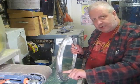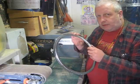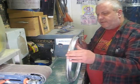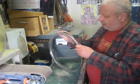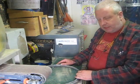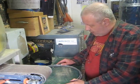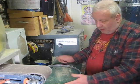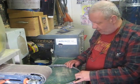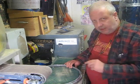It has a distressed look, but a distressed look is better than a flaky look. So what I'm going to do is carry on working on this, get rid of all the flaking chrome, and just rough up the existing chrome so it has that sort of stainless steel, brushed steel look. Hopefully it will be a success, and if it's not, well, I've learned something. If you don't try these things, you don't know whether or not they're going to work. Worst case scenario is it will go back on not looking very nice and distressed, rather than not very nice with little bits of chrome coming off and getting stuck into your fingernails, or worse still, in your eye.